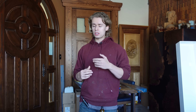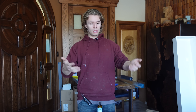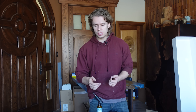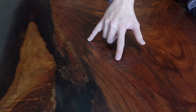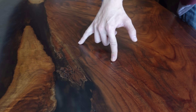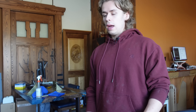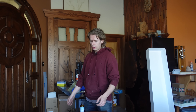One thing with polyurethane I'll mention — it's not as easy to maintain as an oil-based finish, and typically it's something that a professional needs to be hired to spray on. You can keep it looking fresh with the graphene or the ceramic, but any scratches you get — I can see there's a scratch here and a dent here — to fix those, you'd pretty much be sanding this thing all the way back down to raw wood over the whole surface, whereas with an oil finish you could just touch up those sections and do spot repair. That's one difference to be aware of.